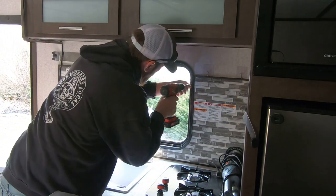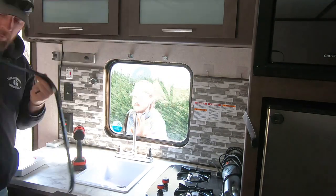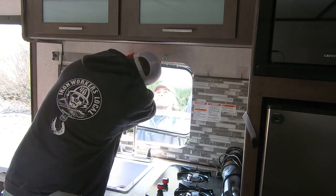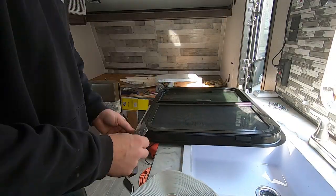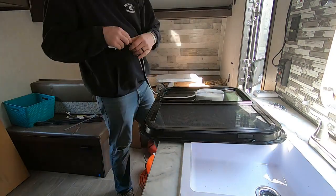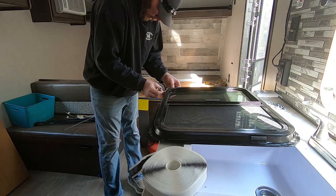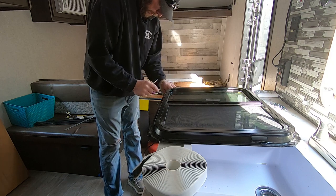For this particular project you're going to need an extra hand, at least to hold the window in while you're taking it in and out. My stepson helped me for a little bit — he had some work to do on his house. Here we're just removing the old window; we pulled all the screws and kept them all because you'll need them for the reinstall. Here I'm just pre-caulking with some butyl mastic — I got the black stuff, which comes in different colors.